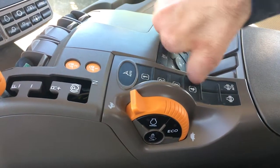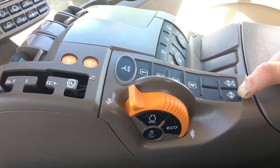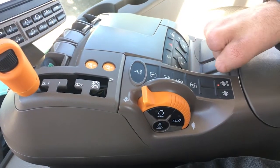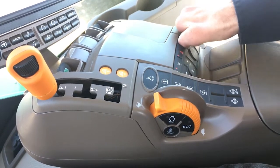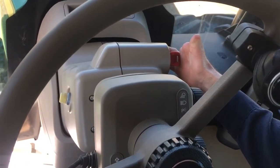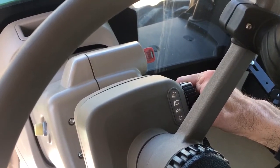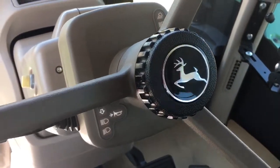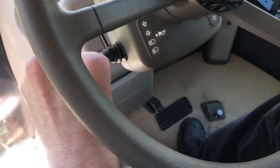One, two, three, and four we do not use — those are for iTech. Here's your differential lock — you have the pedal or the button on the floor below the steering wheel just like in the past, and also as a soft key here. Auto will keep it on except for when you turn real hard, and then this is full lock and stays on permanently. Up here you've got your beacon, your flashers, and your light function one and two. Your radio — self-explanatory. Your AC and heating as well, just like in previous cabs. Your key is up front, lights off, parking for the side of the road or the field, flashers for going down the road, and your full field lights. Here's your windshield wipers. The steering wheel adjusts up and down by pulling the black lever, and the foot pedals are on the floor on the left side — just like in the past — you've got your bright/dim, your blinker, and the horn.